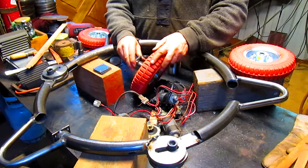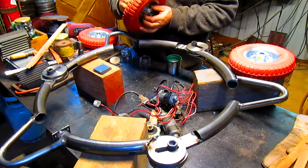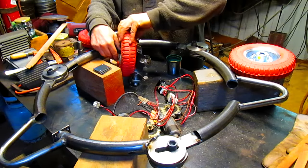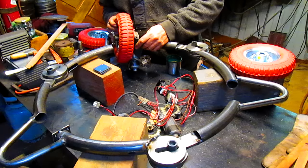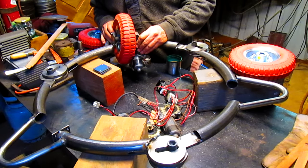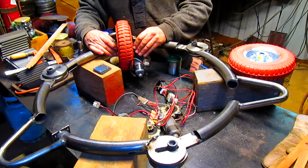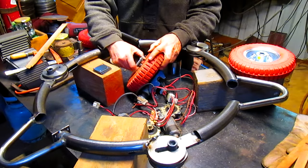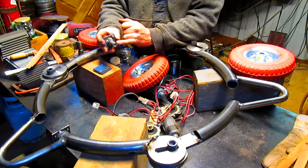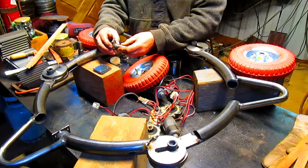Okay, shaft backing wheel. There we go. Motor back in shaft. And add that one little piece and nothing fits, of course. All right. So, we maybe will put this back in the lathe and take off the thickness of this piece of material here, and that'll give us a little bit more room to slide that in.